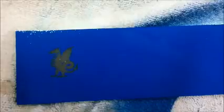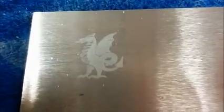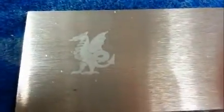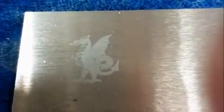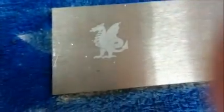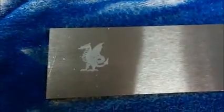And now I'm going to clean off the blue ink with steel wool and methylated spirits. It cleans up fairly easily. So after it's been cleaned up, you can see there how it's now been etched. That's a reasonably deep etch. It's quite good, and it's still fine. It's still kept the detail, which is what I like. And so now that's ready to go.